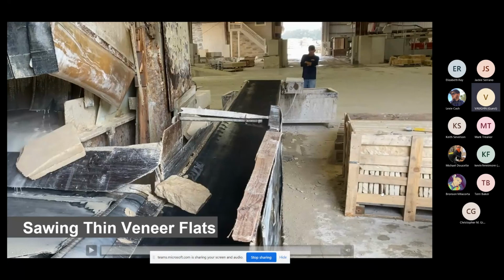But if I have those big bulges on the face of that veneer, all 4 edges would look thinner than this when I run it through the thin veneer machine without hammering that face off. We want this nice, consistent thickness from the top to the bottom. And that's why he was tooling those pieces so hard.